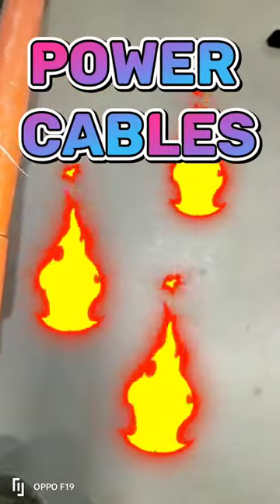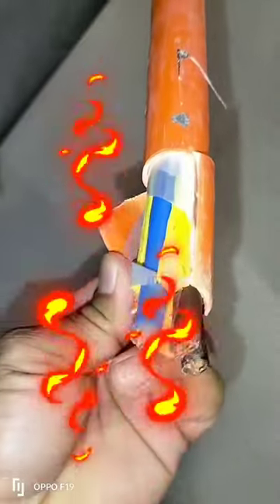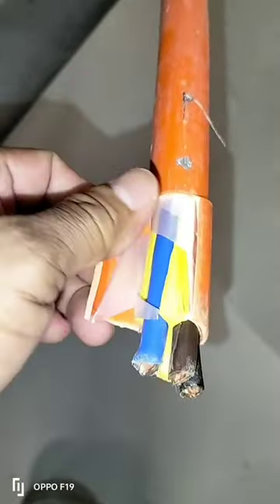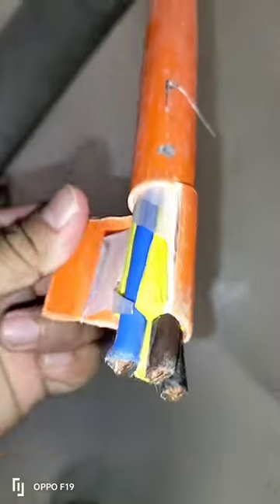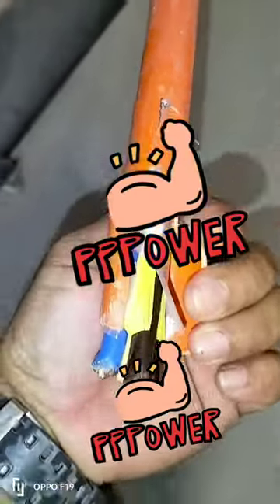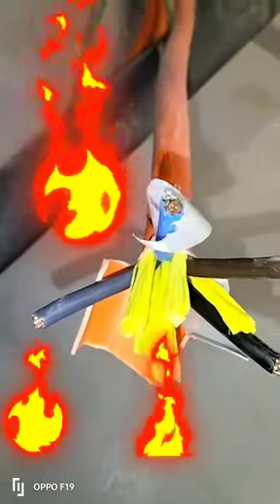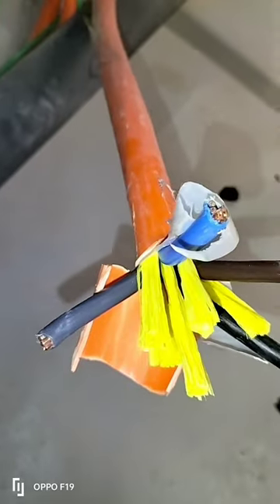Power cables — classification fire-resistant cable XLP, a cross-linked polyethylene plastic. As you experience how to remove insulation, it's very difficult to remove. But a fire-resistant cable, temperature up to 90°C, rated at 600 volt for core cable.